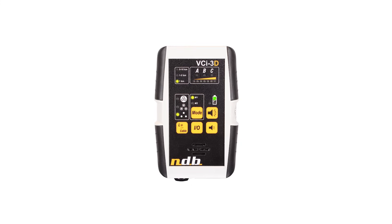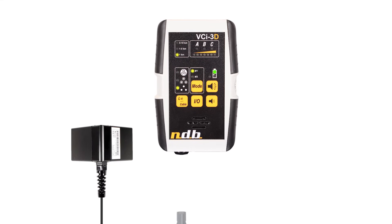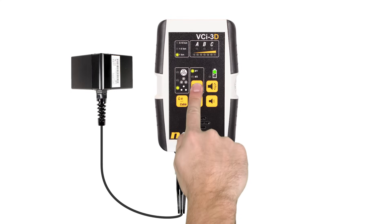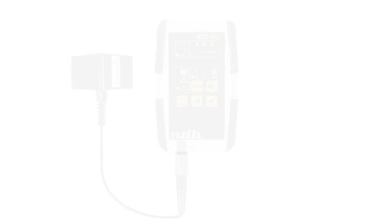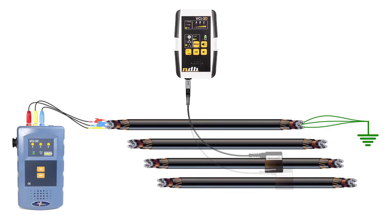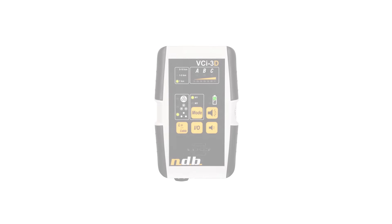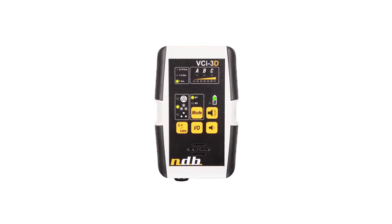The operator may need to identify a cable in a trench containing multiple power cables. In cases where we have paper lead impregnated cables, connect the VCI3D-SV high-sensitivity sensor to the detector unit. For this application, Mode 2 should be selected on the detector. Apply the sensor on different cables found in the trench. In Mode 2, Cable ID Mode, applying the sensor on the cable will cause the A, B and C LEDs to turn on and the voice message will be played back. The detector's gain may be adjusted as needed.